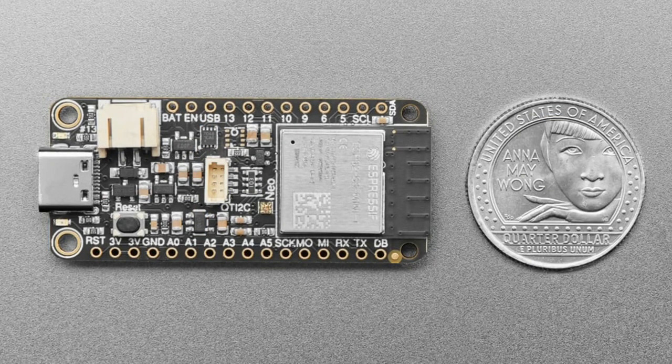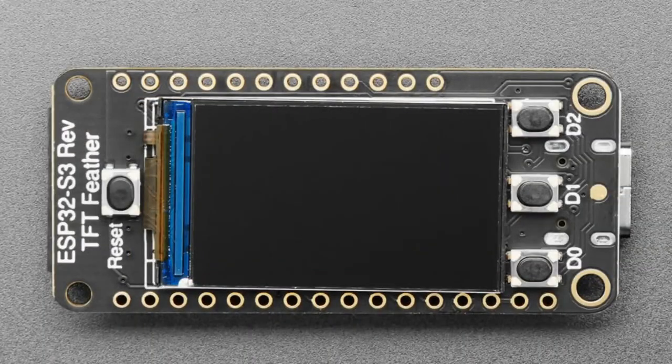It's got USB-C for data and power. It's got a LiPo battery that charges automatically, a reset button, a STEMMA QT port for I2C, and two 3.3 volt regulators, one for the I2C port, one for the main board, so you can have ultra low battery usage and power. Max 17048 battery monitor, so you can check your state of charge. A little NeoPixel for NeoPixeling. And then all the GPIO you need: I2C, analog input, SPI, UART, etc. GPIO, plenty.